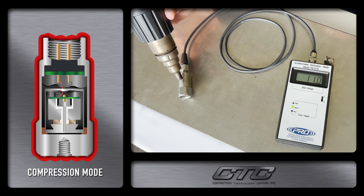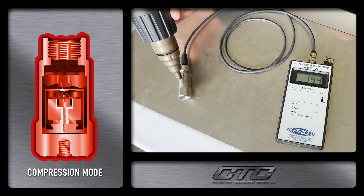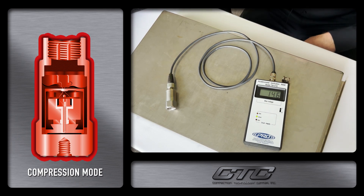And you can see that only a few seconds in, we are seeing a dramatic increase in the bias voltage. We have now gone 2 volts higher, 3 volts higher. And you can see here that we have settled somewhere around 14.5 volts. We will turn the heat off now — 14.6 volts, which is a full 4 volts higher just with heat applied.